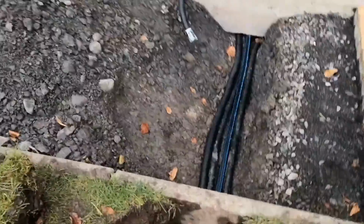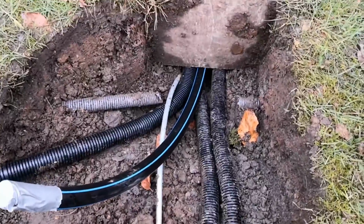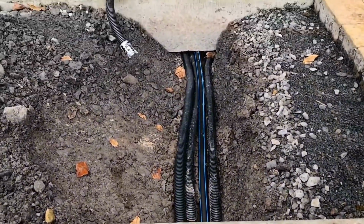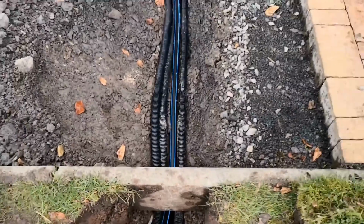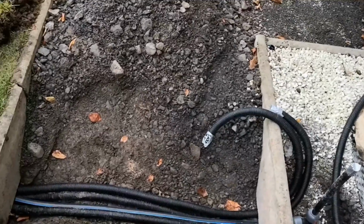I just accomplished what I had planned for today. A little. Here I leave it open. Everything will indeed be connected here later. I can just close up the sidewalk again, just a bit. First, I will carefully embed the pipes with bedding gravel and sand. Next, the gravel is installed, thoroughly compacted, and leveled off.